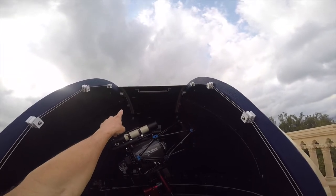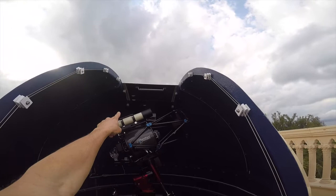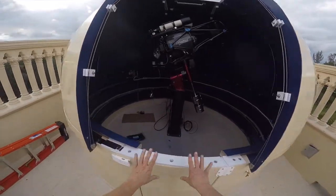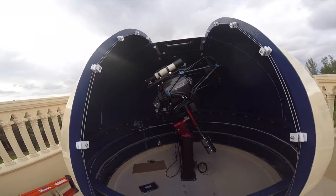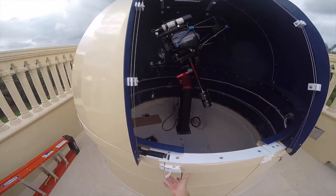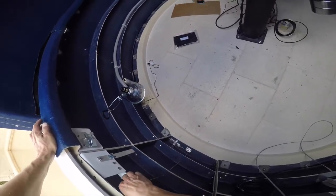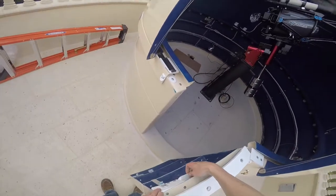Up here on the left you see a little white box, and there's a corresponding white box at the back — it's a magnetic sensor. When they get close to each other, it will automatically stop. The shutter will coast to a complete stop. To enter the dome, there is the door here, but there's also this ring. This ring must always be latched. If it is not latched, the shutters tend to spread apart and then the dome falls off the wall. To unlatch: a two-step process. We first unlatch it here, then on the inside there's a latch, pull down a handle, there's a bar, and a bolt at the bottom. Pull that up and then we can open both sides simultaneously — they just swing out.